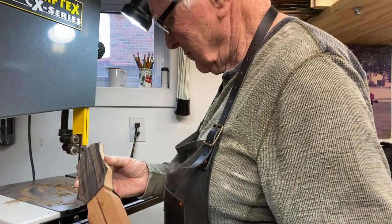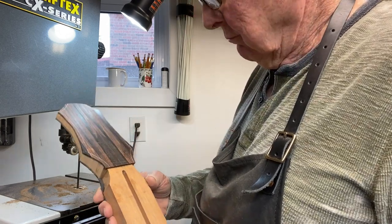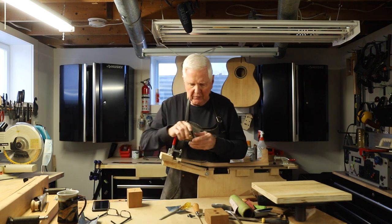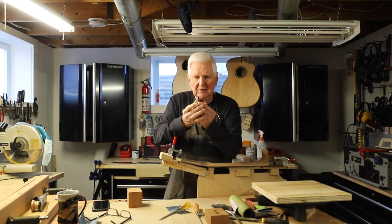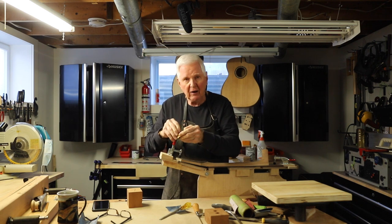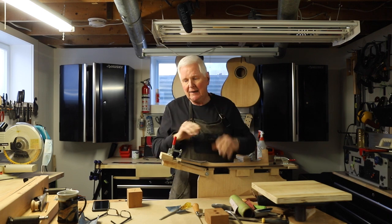Stay away from the power tools unless you know how to use them, because it is extremely, extremely dangerous. Once I have this rough cut done, the next thing I do is I go to the router table. If you don't have a router table, I'm going to show you other ways to do all of this without using power tools that are safe. But if you have a router table, you'll notice that with this collar, you have sticking up through the middle of it something that looks like this — and that's your blade, spinning at 10,000 revs a minute. That's pretty fast. So it will take your hand off or your finger off, or cause a serious accident.